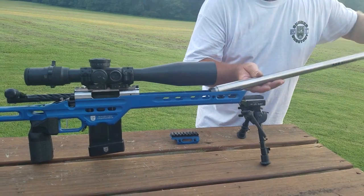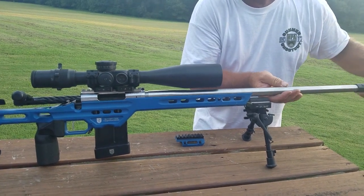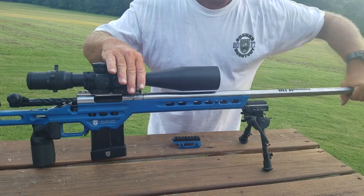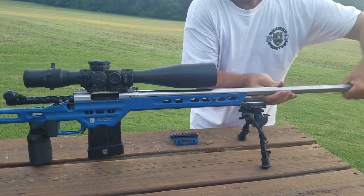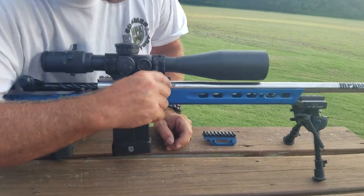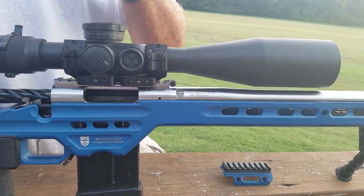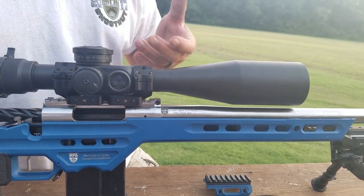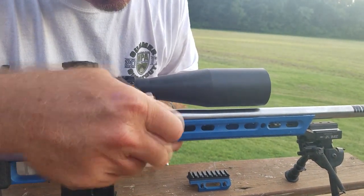I've taken the existing barrel off. I'm going to take the other barrel and run it back through the recoil lug and screw it back onto the action. You're just tightening this thing up to hand tight where it's up against the face of the recoil lug into the action. As I rotate it back up in here, I'll show you the witness mark you're looking for — the consistency of the clocking of the barrel back onto the action. You can see that the top of our logo is in line with that radius. For the barrels we provide to customers, there'll be a witness mark for consistency in clocking so you know every time you reinstall this barrel it's in the same position. Once the barrel is installed and tied up against the shoulder, I take the T25 again and tighten up on the switch lug. And that's it.